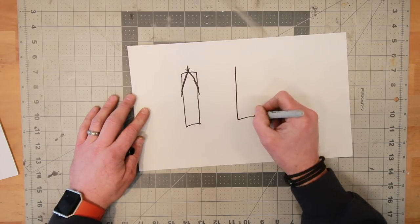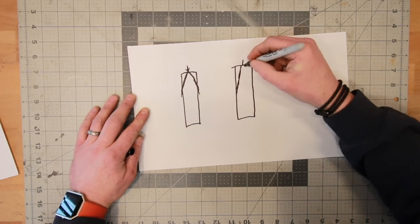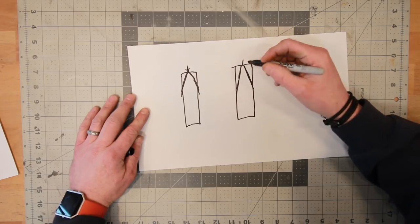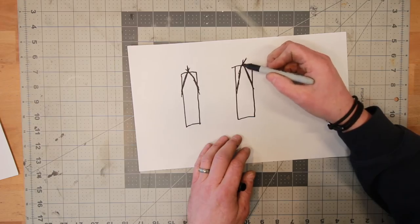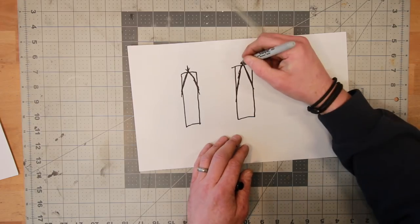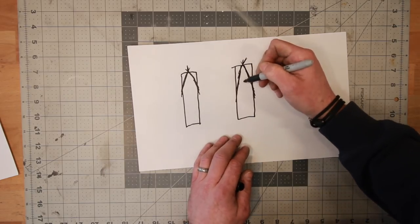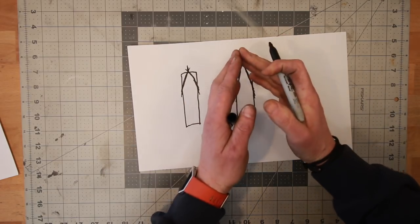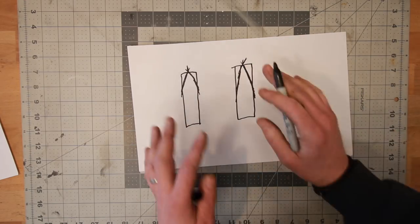So what we're going to do, this will be our cutting edge. We're actually going to grind a flat grind in there first. And we're not gonna take it all the way. Once we get that established, then we'll switch to our rotary platen, which is a slack belt grind. And we'll start putting that on. And what we'll end up with is a much more gentle transition to the spine from the cutting edge. And it'll leave the blade thinner towards the cutting edge. It's still gonna have a lot of meat there just because of the nature of a convex grind, but it's gonna make for a lot less chunky knife and a lot better cutting action. So that's the reason we're gonna do that.